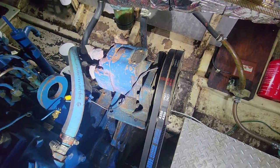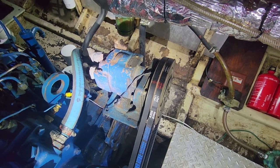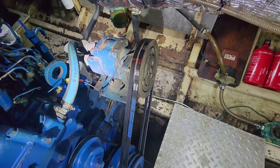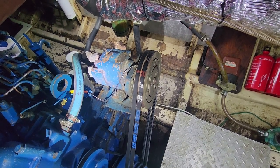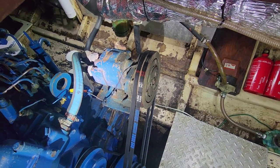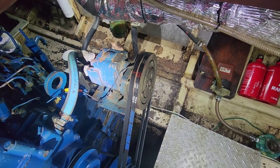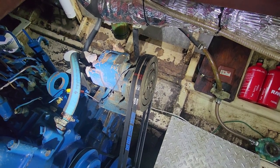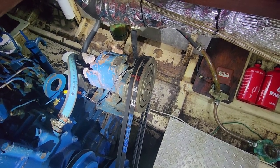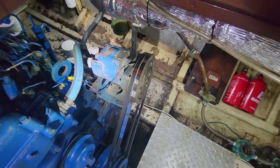The inner part is attached to the hydraulic motor and it begins pumping fluid. This pump only pumps one way. The stern thruster obviously goes in two directions — port and starboard — but this pump only runs one way. I'll show you how it diverts fluid one way or the other to the motor, which does reverse. So the pump does not reverse; the reversing action takes place at the motor through two valves. Let me get down and show you the control side.